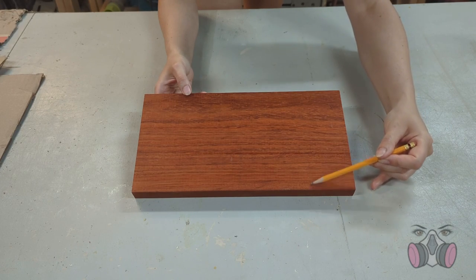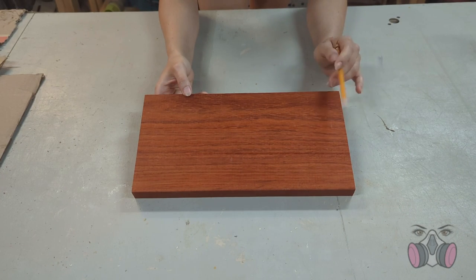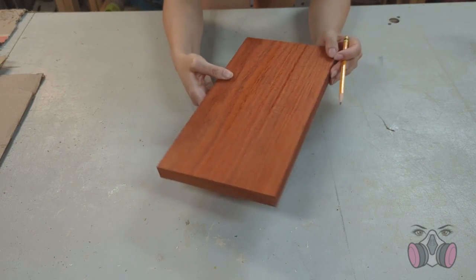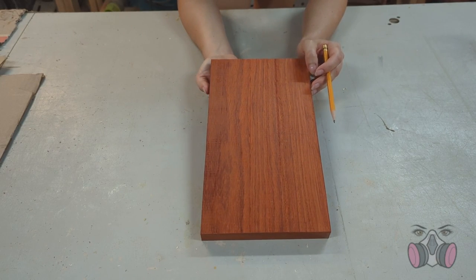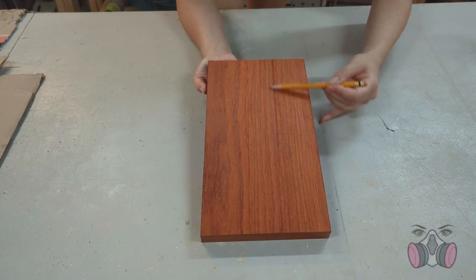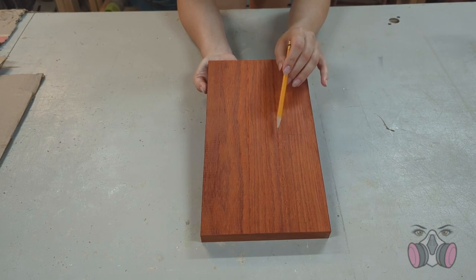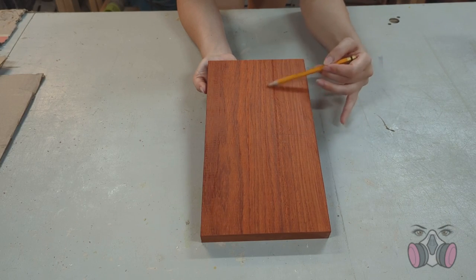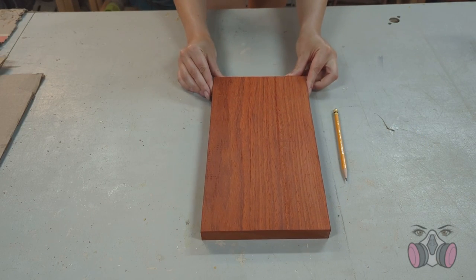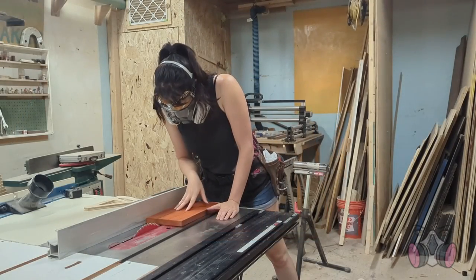This height I have here is already perfect for what I need. I initially wanted to cut the piece along this way, because that way I have the biggest piece possible left over for a future project. The problem with that is I have to keep in mind which direction the grain goes, because that determines how much force the wood can take before it breaks. I don't want it breaking as I'm trying to jam it into my hair — I've had pencils break in my hair before. So I'm going to cut it along the grain, use the top half to make the fork, and save the bottom half for something else. This isn't ideal scrap optimization, but I have to consider the placement of what I'm making, not just how the scraps are going to be left.